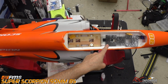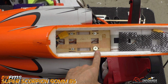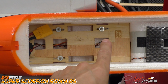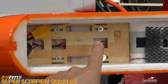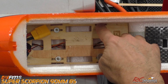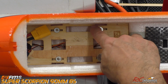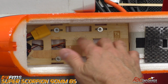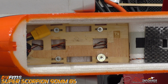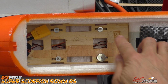Now, right after putting the shelf liner in position and putting the battery straps in, I did run into one snag that I thought might be a problem. After drilling all these extra slots, the wood becomes kind of weak here, and as I was tightening the straps, the battery started cracking this wood here. So I saturated it with some thin CA so it absorbs in there. Additionally, you can see the screws in here, and I left those in position just so everybody could see what that looks like.